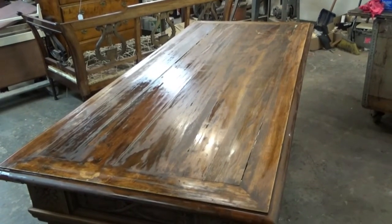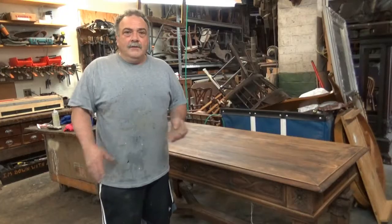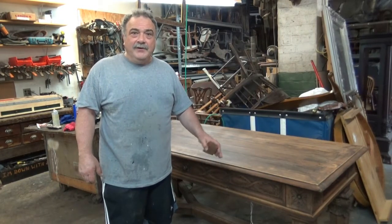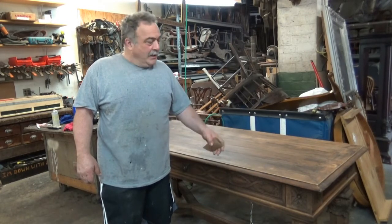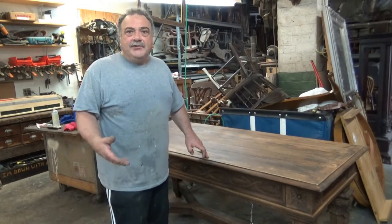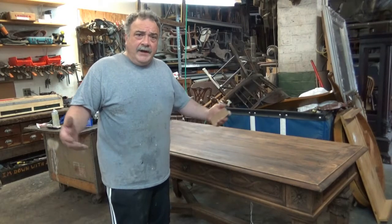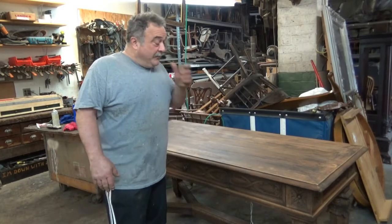Next time we're going to neutralize it with vinegar; if not, we're going to give it a second coat. There's one thing to keep in mind about this table — there's still a patina on this top that was there before the fire and before the table got painted over. Even though there are these marks on there, it's only about a thousandth of an inch into the wood. That's the effect from the sun bleaching it out a little bit, air, oxidation — those sorts of things leave a color on it.